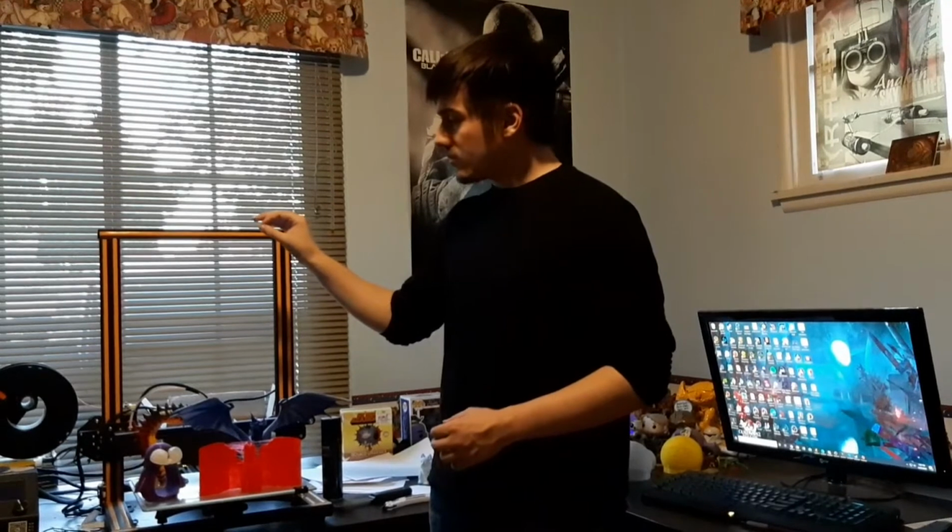Personally, I choose to use PLA filament. It has a lower print temperature at which it burns. It's easier to use, however, one of the cons is that it's susceptible to clogging. Another filament to use is ABS. ABS is a higher temperature that it burns at. It's harder to use, but it's more durable. Another con of it is that it produces fumes when printing, so it's not the best in small spaces.